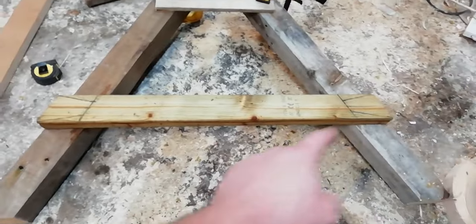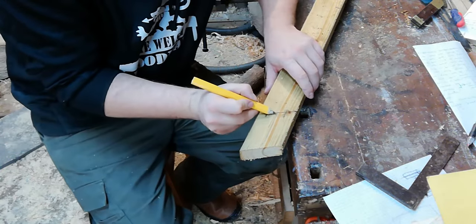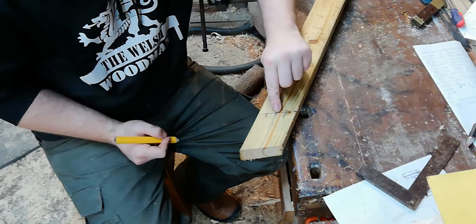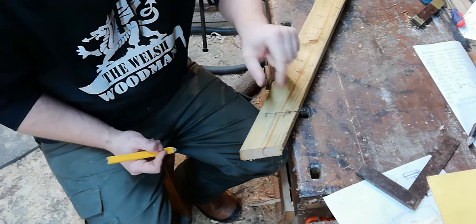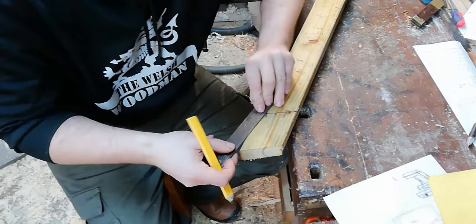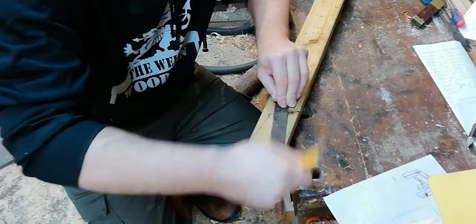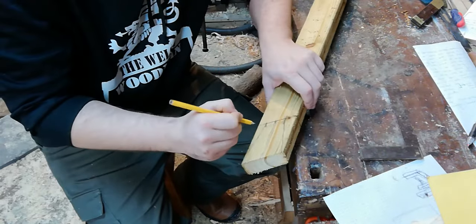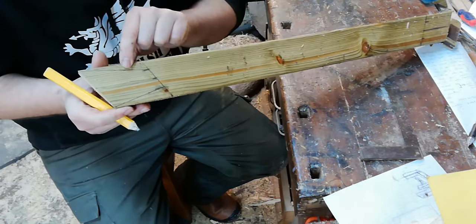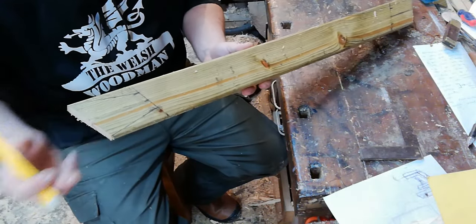I'm going to show you how I've laid out this dovetail. I've drawn that angle — imagine that's my leg — I found the centre point of that leg by measuring the middle along that diagonal. Either side of the middle point I've measured 15 millimetres, so the bottom section of the dovetail is going to be 30mm in total. We just get a nice straight edge from the corner, line them up the same on the other side, and that gives us this angled dovetail. On the outside of those lines I'll be removing those sections, and we're going to use the bandsaw for this.